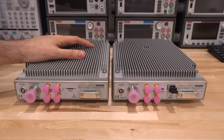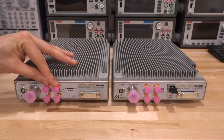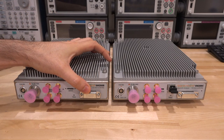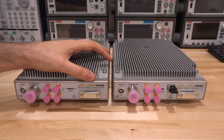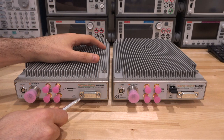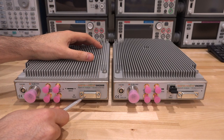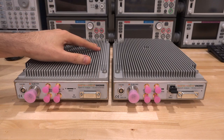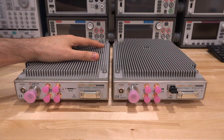Looking at the front panel, both units have power input, RF input, GPS, trigger, 10 MHz reference, and GPIOs controllable through the API. You can program them for antenna switching or triggering — the GPIOs are fully in your control with the software. This instrument is designed for you to write your own code on top of it, though it also comes with a very nice GUI interface.